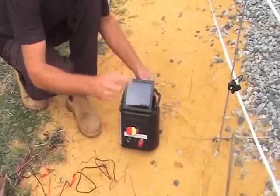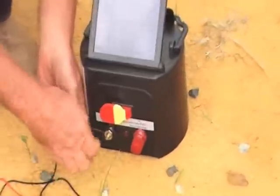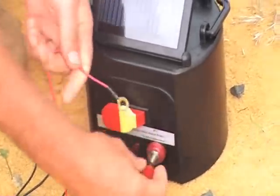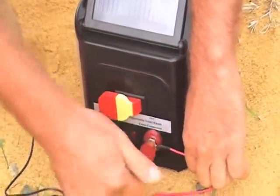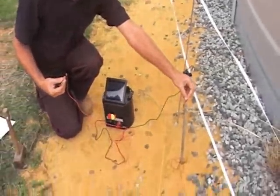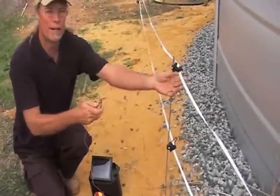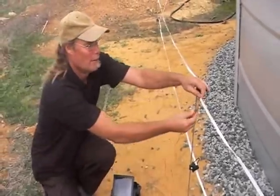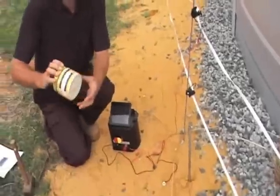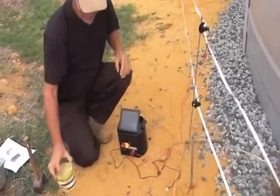The red terminal is for the live wire. The black wire connects to the bolt on the earth or ground terminal. The red wire has a clip on the end to make it easy. We like to use this tape, but you can use steel wire or anything else to make an electric fence — it clips on there. One thing I like to do, since grounding is the most important part, is use some general purpose grease on your finger and just smear it all over the earth connection so it doesn't get a bad connection.